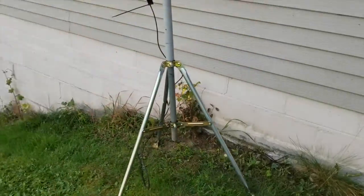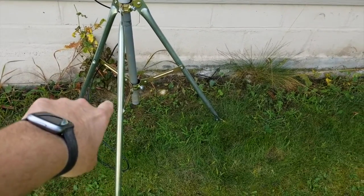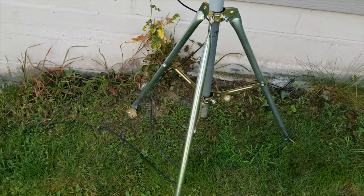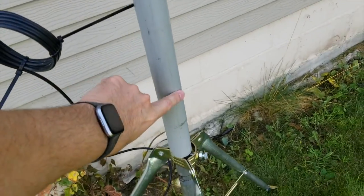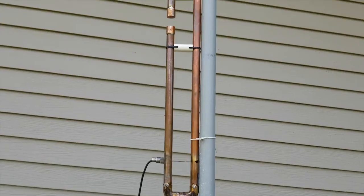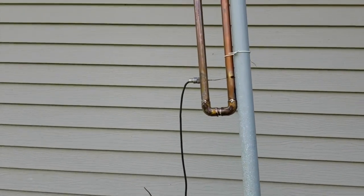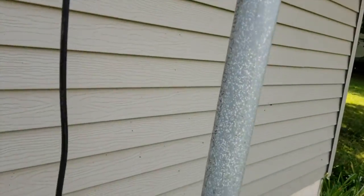Today is to put this up on the roof. So it's a standard, I think it's a GE, I don't remember the brand, I got from Menards, just a standard tripod mount for TV antennas. The first plan is to get this stuff mounted up here and screwed in so it doesn't fall apart. This here is good, so we're going to just trim those up and otherwise call it good, and then tape it on there so there's no stress on there. Tape this up because there's a big hole there, to avoid the water.